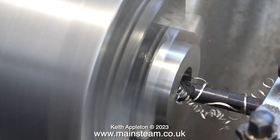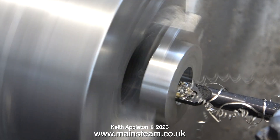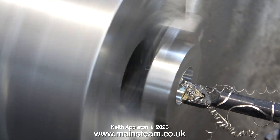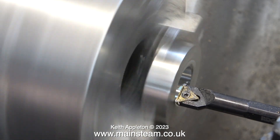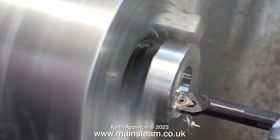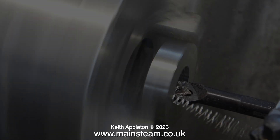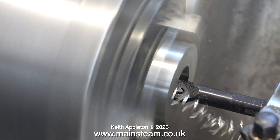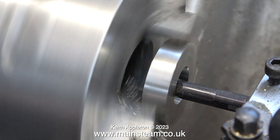Once again, you've just seen me go through with the boring tool, then without altering any settings I pull it backwards out of the hole. If the boring tool weren't so small, what I could do is pull it towards me across the front and face the front with the boring tool. But this is a very hard piece of stainless steel and I didn't want the boring tool to be destroyed by pulling it across the front.